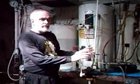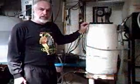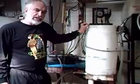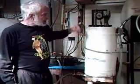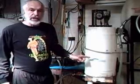I use that figure from that test to mix up sodium hydroxide and methanol. I mix that in a certain percentage according to my test and that makes sodium methoxide. Sodium methoxide is a mixture of methanol and sodium hydroxide. You mix it up and put it in here in a certain percentage and it stirs it until it's completely dissolved.